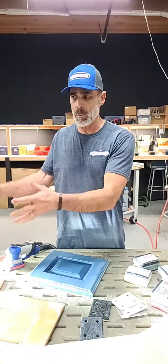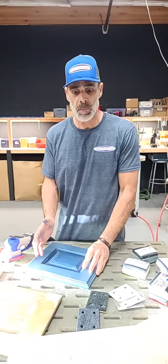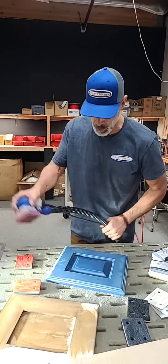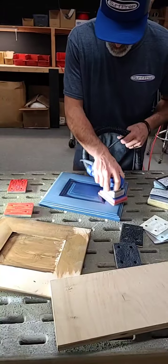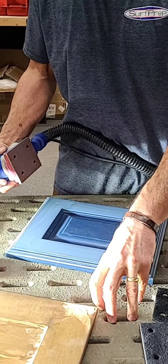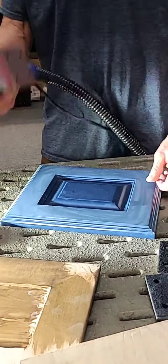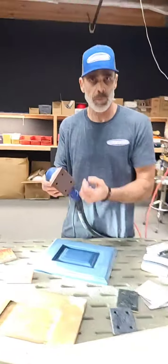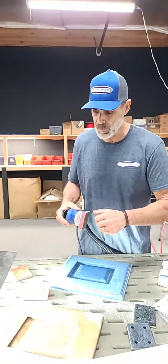If I'm working in your shop with a rolling rack of 40 doors, I'm going to figure out which combination gives the best result. I'd personally gravitate toward the half-inch and probably the 10 millimeter in very fine to scuff through everything and get a good mechanical bond — though you can bring it down to a medium-plus or even a fine. Also worth noting: my downdraft table was not on and I just scuff-sanded the whole top of this door with no dust in the open air — it's all being collected through the vacuum holes into the hose.